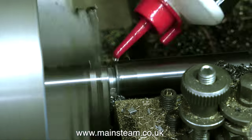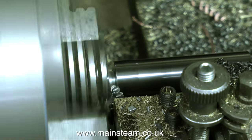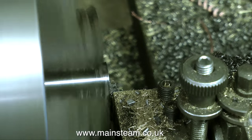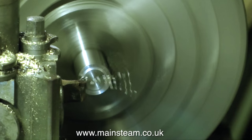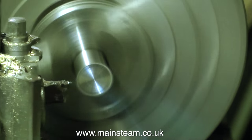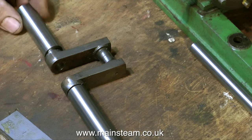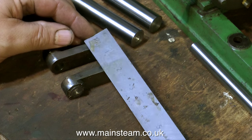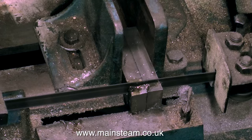You will notice as I'm parting this off in the lathe that I'm using some lubricant — it's just 3-in-1 oil, and it does the trick and doesn't make much mess. Once I parted off the piece of silver steel, I faced it with a carbide cutter. Here you see the two blanks set either side of the original crank web. Now it's time to get the dimensions from the original crank web and duplicate it with the steel that I cut earlier.